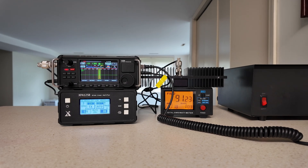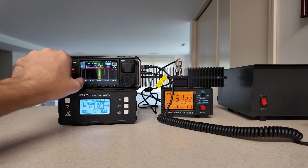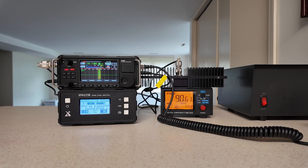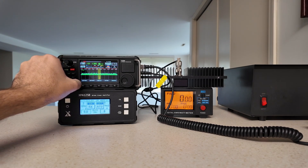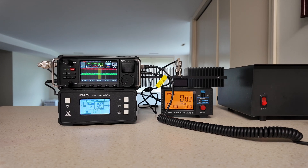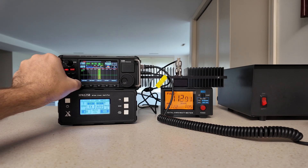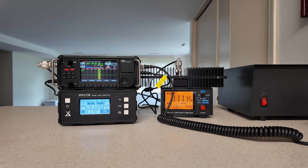This is something that amplifiers do — they don't give you 100 watts out on all bands all the time; it's all relative to drive. So let's turn the drive up a bit, turn it up to seven. We're at maximum efficiency up to eight — we're not going to get any more out of there. Let's go back down to five where we belong. I don't advise going over five because this is telling me it doesn't want to be over five. 20 meters: 98 watts out. 17 meters: 111 watts out. 15 meters: 94 watts out. 12 meters: starting to blink a bit — 113 watts out. I should probably turn that down. Turn it down to four: now we're not blinking anymore, not unhappy, 111 watts out.